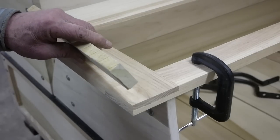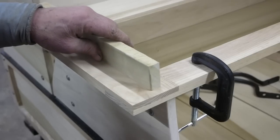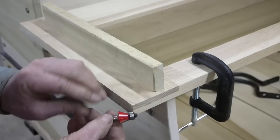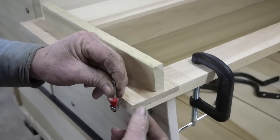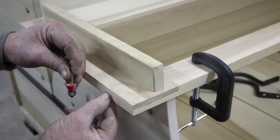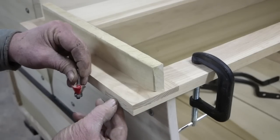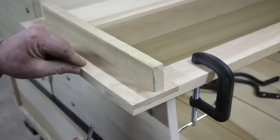So these seat arms and back are going to set in about like so. Well, I think I'm going to take this chamfer bit and run it this direction instead of this direction. It'll give me a more accurate, nice bevel here. And usually these are done to where they just split and they stop right about where this seam is on this joint. So I'm going to chamfer off this corner around the sides and the back.